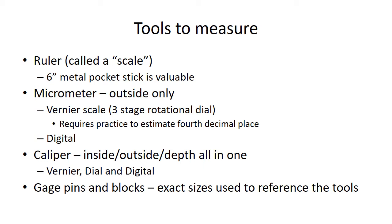With digital calipers, the fourth decimal place is usually a zero or a five. It'll show up on the readout, but you're getting into such fine measurements. The vernier micrometer can do a little better because you can actually figure out those actual decimal places, though it's a judgment call based on experience. There are also gauge pins and blocks of exact sizes, and there are videos in with the drilling videos that explain those.